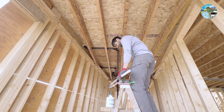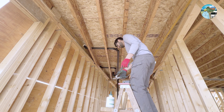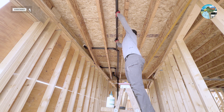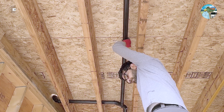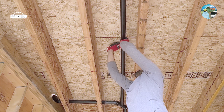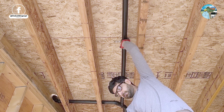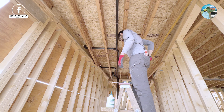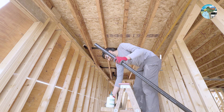We talked about strapping a horizontal piece before gluing. You can see that I did exactly that on this tub trap arm pipe. I put one side of the pipe into the Y hub and strapped the other side, making sure I have an adequate 2% or one quarter inch per foot slope before I glued it into the Y.